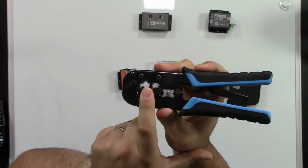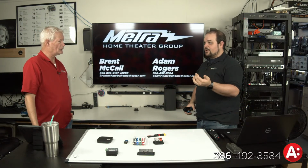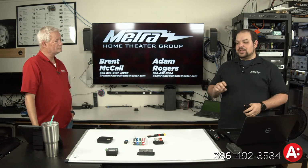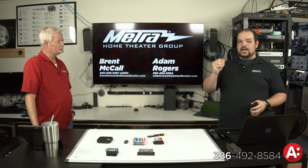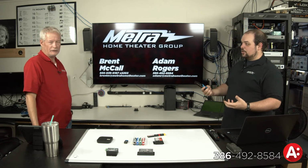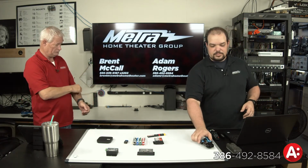But inside, of course, when you put the RJ45 inside of the tool, the teeth come through and push the teeth of the RJ45 termination into the wire. The die that does that, over time, if you're not careful, the plastic that is the head of the termination will break off in tiny little pieces and fit down inside there. You get a bald tire effect where the ridges are not the same all the way across, so the blades do not fully insert into the wire.